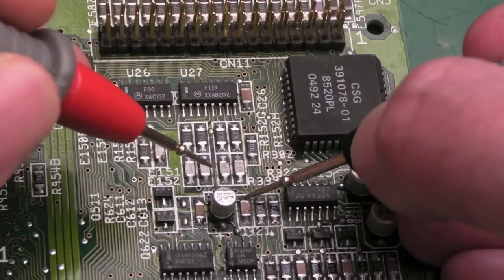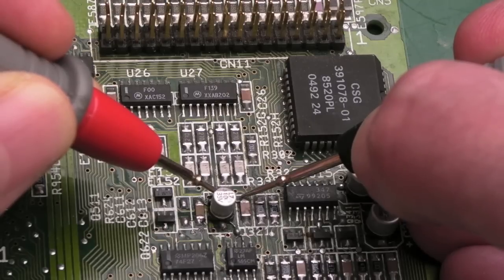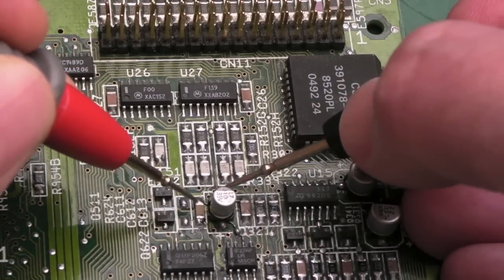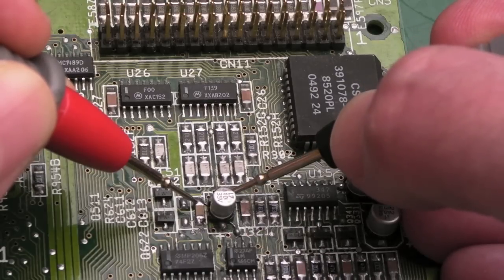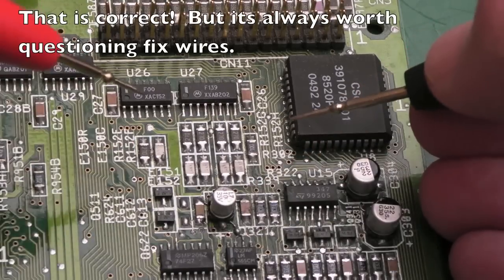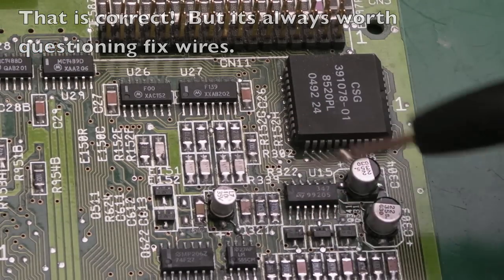So anyway, the first thing I need to check is, should that cap be joined to the negative of that cap? And then it comes across here to this cap, and we've got the same issue. So all three of those are joined together there. Now that could be correct, but it might not be. So I may have to just remove this cap to have a look at where the traces are going, but